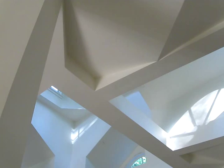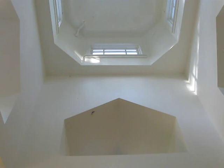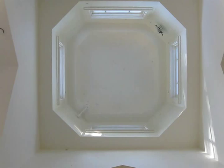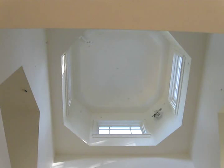Now I'm going to go back up under here, looking up into the dome. At the very peak of the dome, they had some water damage, and so that's what the lift was for — right in the very top. That little black dot that you see up there is wire for the chandelier. There are four hooks up there that the chandelier will be suspended from. They will run chains to the center and then suspend the chandelier, because you can't suspend anything from the very peak of the ceiling — it's all rotted out.